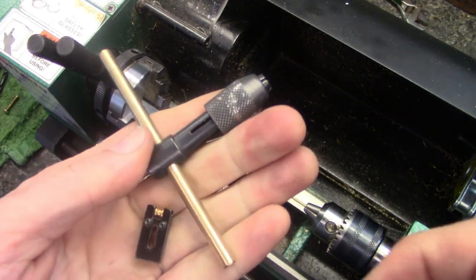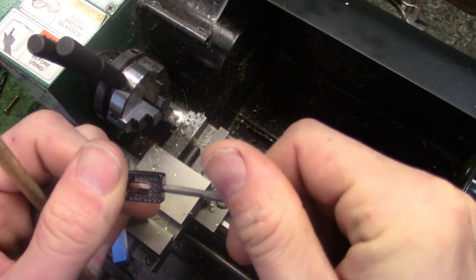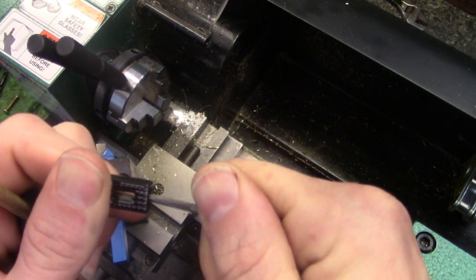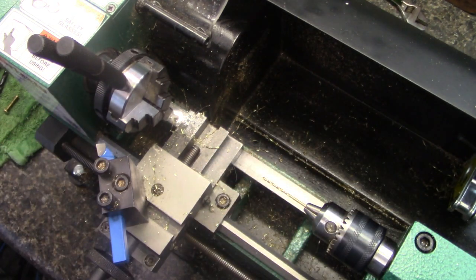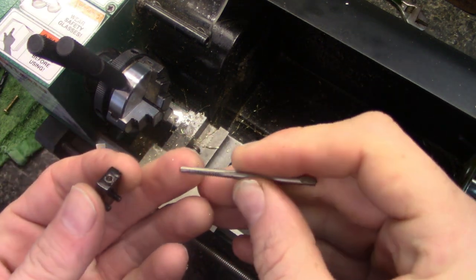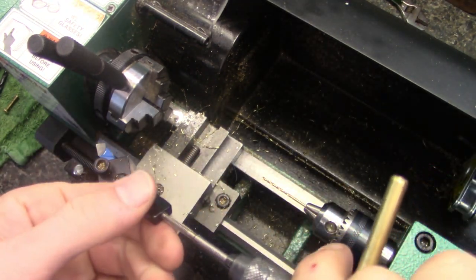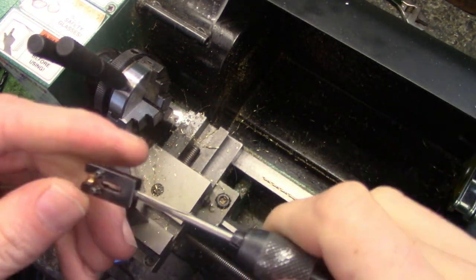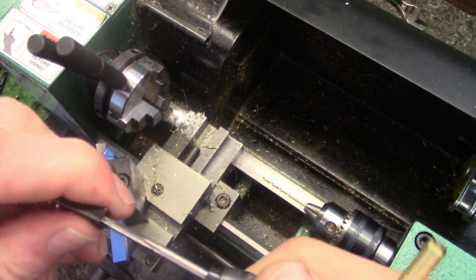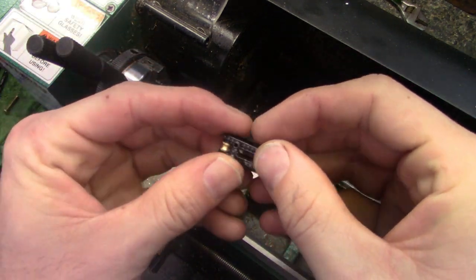As far as this guy here goes, you just use a 6/32 bit and start her out in there and just thread it out. You don't have to actually drill it. I was at first, but it's just as easy to do this. And this one has got a starter on it, which is probably more ideal for what you're trying to do here. And you just start threading it in there. Like I said, you don't have to drill this guy out.